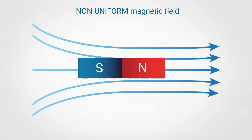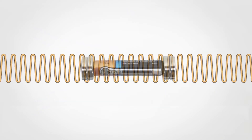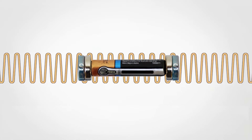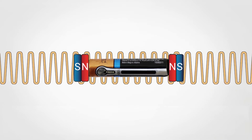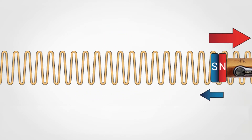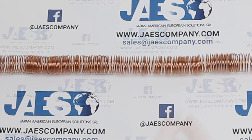But if the magnet is immersed in the non-uniform magnetic field of our copper coil, it will have a bigger push towards the north pole than the south pole. Then, if we place the magnets on the battery facing each other so that the south poles are on the outside while the north poles are in the middle, the north poles will feel a stronger push which is able to counter the weaker push of the south poles. So if the train is pushed inside the coil in this way, it will be able to move quickly in this direction.